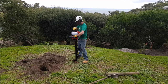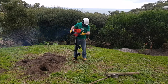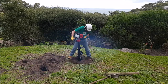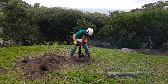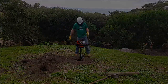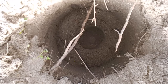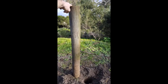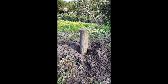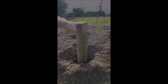I was quite apprehensive about using the 300mm auger based on some other YouTube videos I'd seen. And as you can see in this clip, it didn't work out very well for me at all. I think I was quite lucky to get out of this with just a couple of bruises and scratches. So just be aware — when you use the larger bit it is quite torky. It will grip a root and rip your hand off if it can. These last four photos show the 100mm pole versus each of the holes that I've dug, just for comparison purposes.